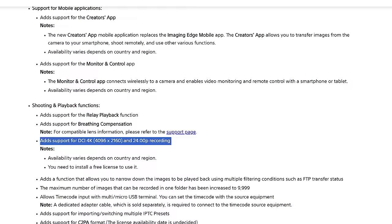The next update is a little more niche but still very useful if you have a need for it: this update enables you to record in DCI 4K at 24 frames per second. DCI 4K is different from regular 4K — the camera records 4096 by 2160 pixels instead of 3840 by 2160, so it's just slightly wider. If you're filming something to be presented in DCI 4K format, you'll be thankful this feature is here, but if you're exporting for YouTube or normal 16x9 screens, I'd probably stick with regular UHD 4K.